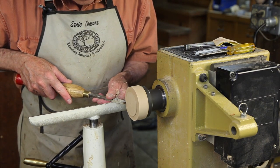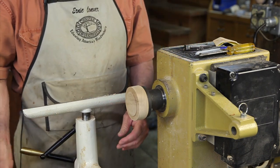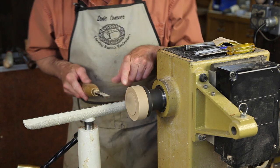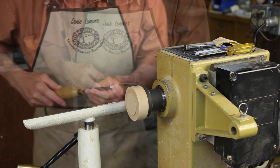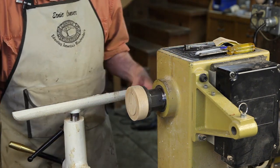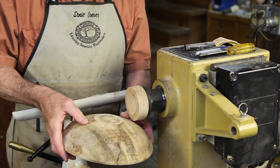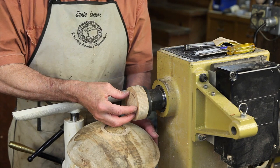I'll take just the distance of the chamfer away and put another chamfer on there. By doing this I'll be able to reduce this tenon a little bit at a time until it fits. We'll now ensure that this is dead flat on the shoulder. It's actually a little crown to the center, so I'm going to straighten that right out. Now it's level. It's very important that that be absolutely flat, and that the bowl drops over just like so. It doesn't have to be a perfect fit — there's actually about a thirty-second of play in there. That's fine, it's close enough. It's the fact that these two level surfaces mate that is the important thing. This is just a centering tool.